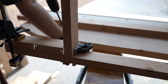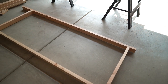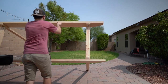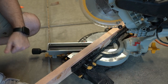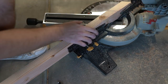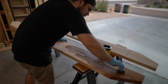I did the same thing on the bottom rungs — these are one foot inset using the template board. Then I joined one side to the other, which gave me a really nice looking frame. I did that for both sides, then took it out to the backyard for a test fit. For the carriage bolts, you just tighten them down and they'll seat themselves. I pushed the arbor up and it looks really nice, but it was a little wiggly, so I added some braces — cutting 45 degrees lengthways on 2x4s, one foot long on the long side. I went back and sanded off all the marks as well as all the edges and corners, which helps prevent splintering if the boards catch on anything.